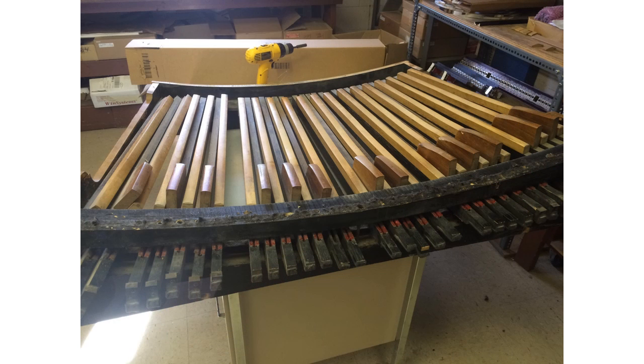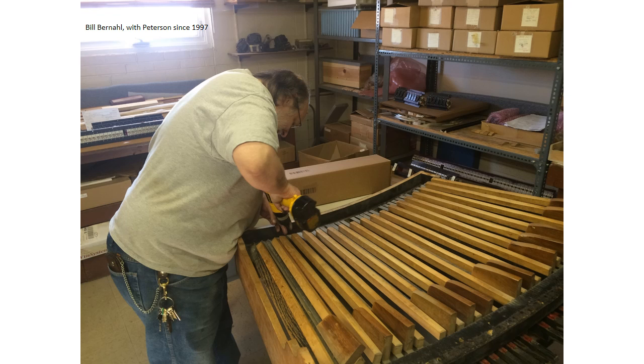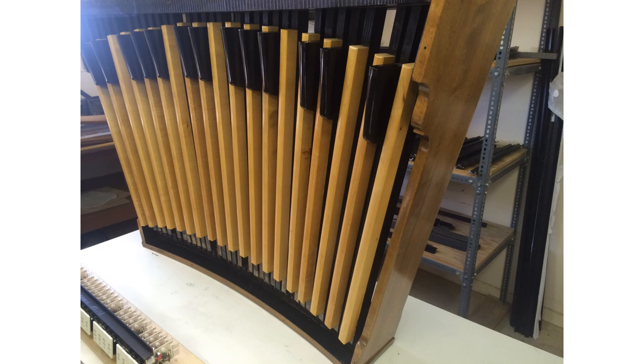One important part of a complete console rebuild is the renewal of the pedal board or, in some cases, the decision to replace it with a new one. We start the pedal board rebuild by removing all of the pedal keys. Replacement felt and natural and sharp keys were secured to the repainted key structure in the refinished frame. New springs are utilized whenever possible.